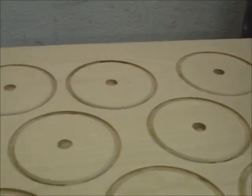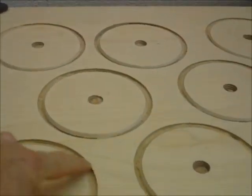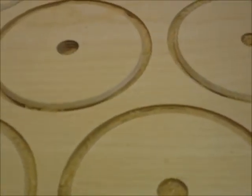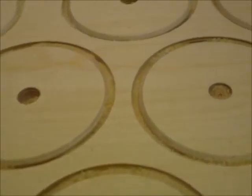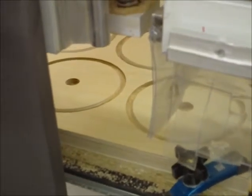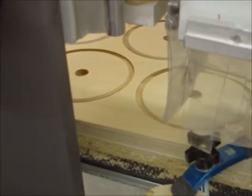As you can see, we've finished cutting all the chamfers in these edges here. They all have a nice, about a quarter-inch chamfer on the side. So now I'm going to take the V-groove bit out and put the straight cutter in and finish it off.